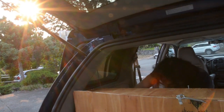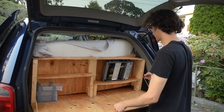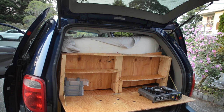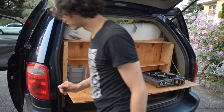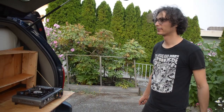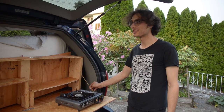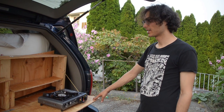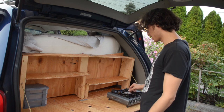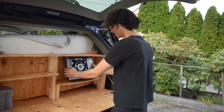He built a six-inch wide shelf unit at the back, and it's 16 inches high. You can store all your kitchen needs in there, but it's only six inches wide so you have to think about what you're putting in there. There's also a 16-inch by four-feet wide door, and we just use metal chain to support it when it folds down, and it also rests on the back of the bed frame. This is essentially a table built into your bed frame.